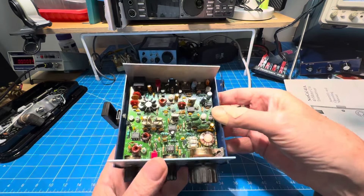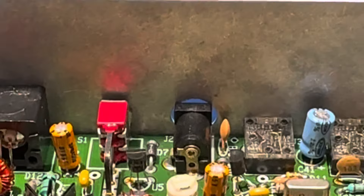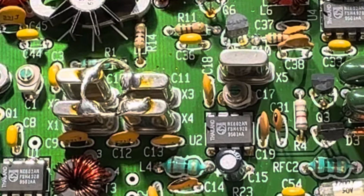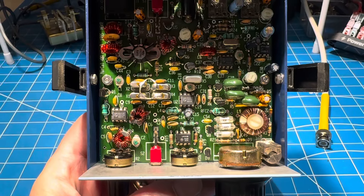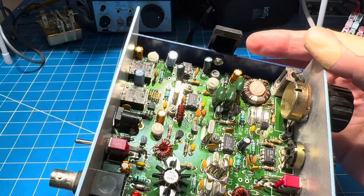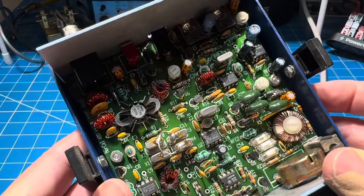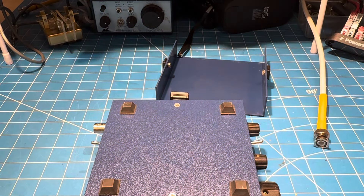The lid is clean. We have a new camera this season, so we can zoom in a lot better than we used to. Let's get under the light and do some looking. I don't see grounded crystals — I see a single-turn pot. There's the kind of view of the whole thing. It looks like it's complete. It's got, I think, its original 2SC799 output. The toroids haven't been glued down. Everything looks to be in pretty good shape. There are two screws we can take out and look at the soldering.